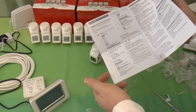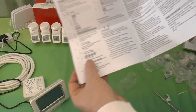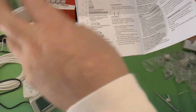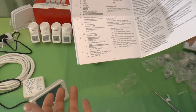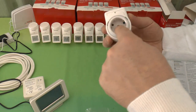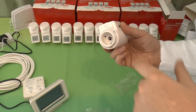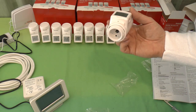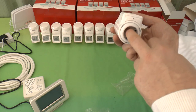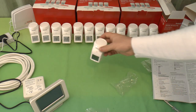And there's also an option here for the valve stroke. You can take a look there. If when it tries to wind in the radiator, it doesn't fully close off the radiator, there's an option there. And you can adjust the length of travel on this, so it'll actually try and drive a lot more to hopefully work with other radiator heads. I'll probably end up having to do that on these ones, but I'll try it without first. Anyway,